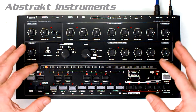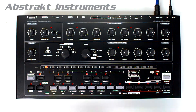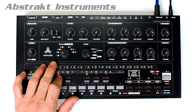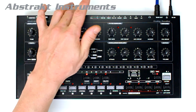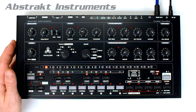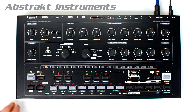MIDI input data is merged from the DIN MIDI and the USB MIDI input, so they can both be used at the same time. If you have sync in set to MIDI, it's going to grab the first clock that it sees. If it sees the USB MIDI clock first, it's going to sync to that and ignore any subsequent clocks from the DIN MIDI, and vice versa — if it sees MIDI clock from the DIN MIDI input first, it will ignore any additional clock inputs from the USB MIDI input.